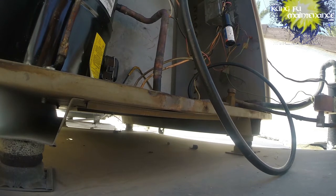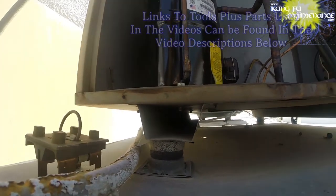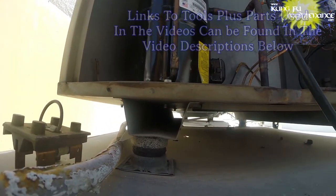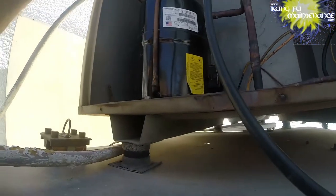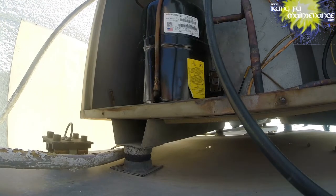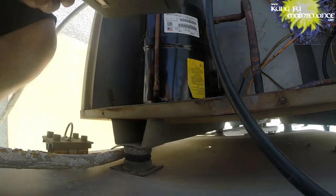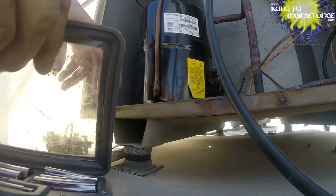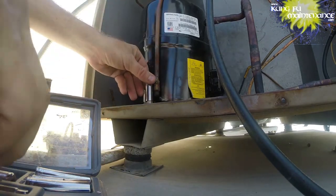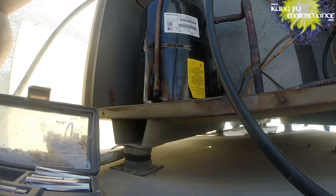Okay. This is where we'll be pulling the vacuum from. And now we'll be detaching the compressor. Zero. Okay. So for the compressor, we'll need the ratchet set. I need a new red hose. Red hose. Okay. Recovery machine's done, in theory. Now we've got a ratchet set. This is most likely a standard, but all I have is metric. It should work. Looks like a 14 millimeter, 13 millimeter.